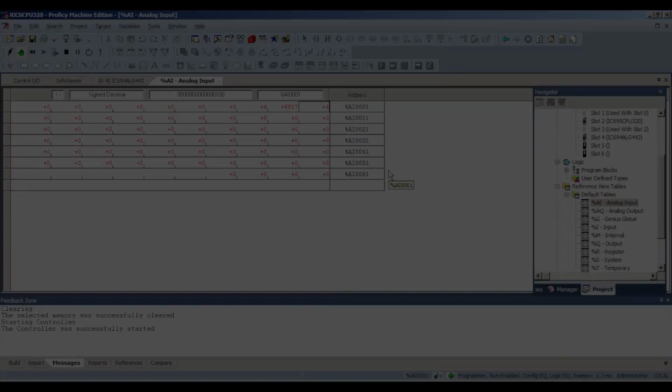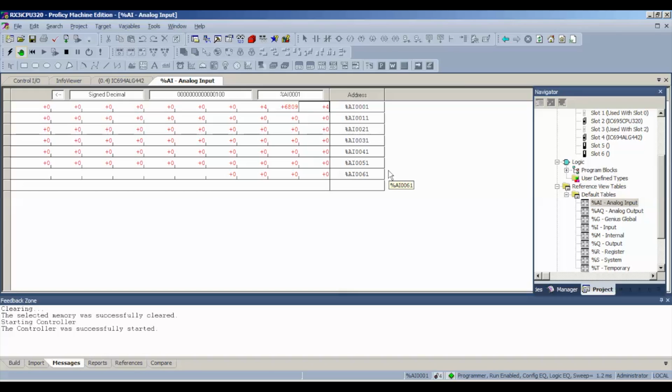Now what I'm looking for is the same exact range, or very, very close. Same engineering units, okay? If one of the channels is reading way off and all the settings are the same for all 4 channels, then there's obviously a problem with that particular channel. And as you guys can see, all my channels are reading the same right now. Okay, so I'm satisfied with the inputs.